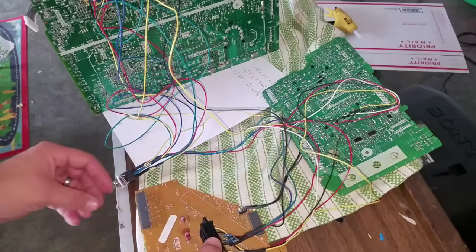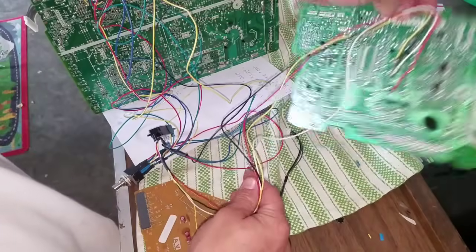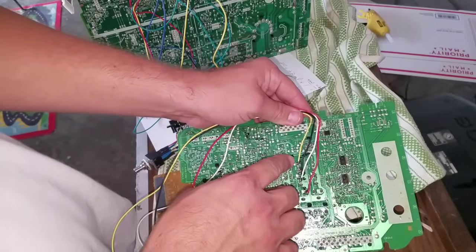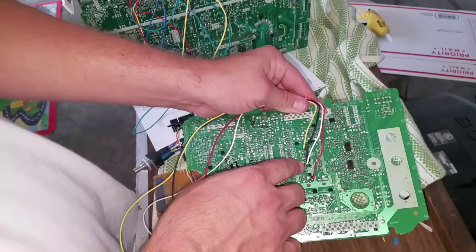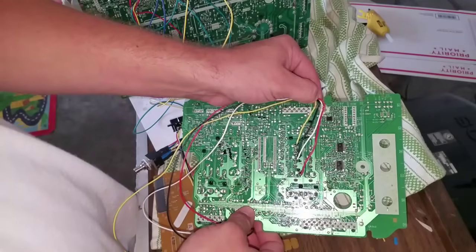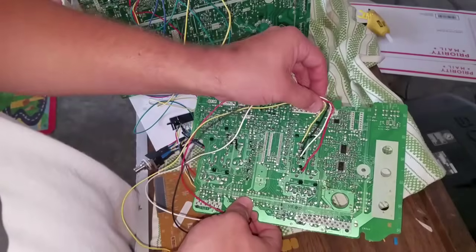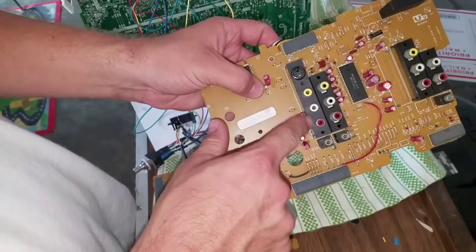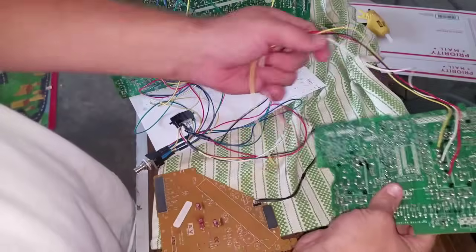We're coming down here from our lines and taking some of our lines straight from the audio and video board here. You can see I'm getting a ground signal, my video for my composite, and audio left and right. I do use a little bit of hot glue at this top portion to protect the solder from being pulled — I don't want to lose my connection on there. You can just see the backside is where we tapped into those lines, and that goes into the other side of the SCART head.